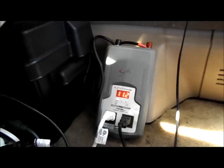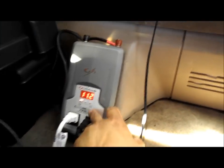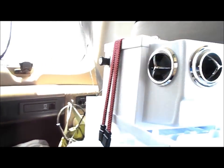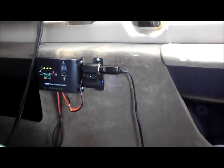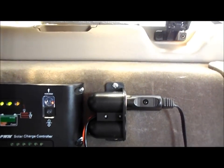Solar is not going to be able to keep up forever and the battery is not going to keep up forever — solar is feeding it but I'm doing 150 watts right now. Now I'll turn on my AC. Notice the voltage stayed at 11.2 — it actually went up a tiny bit — because I'm not borrowing any power from the battery for the AC. Probably only about 0.1 volt difference when I use power off this direct solar output.